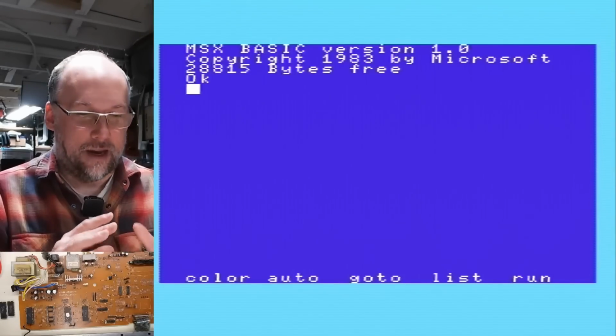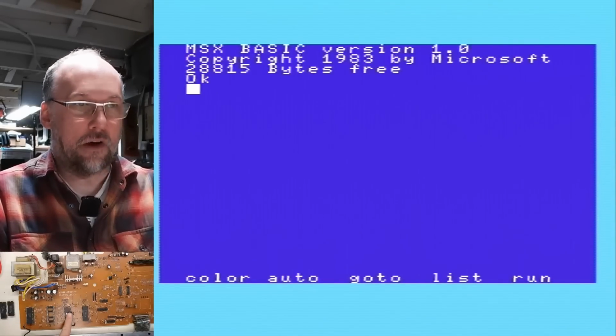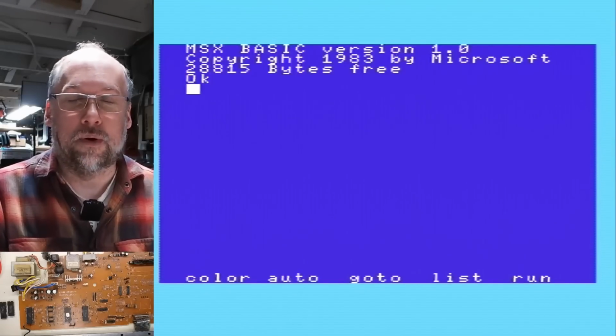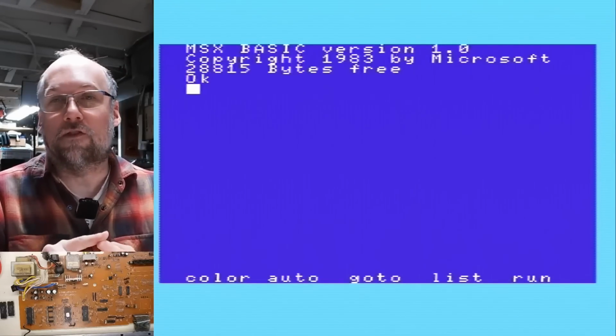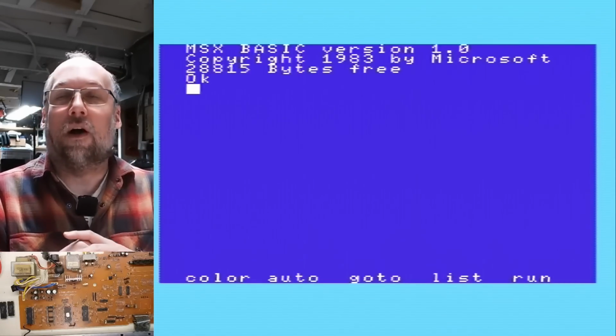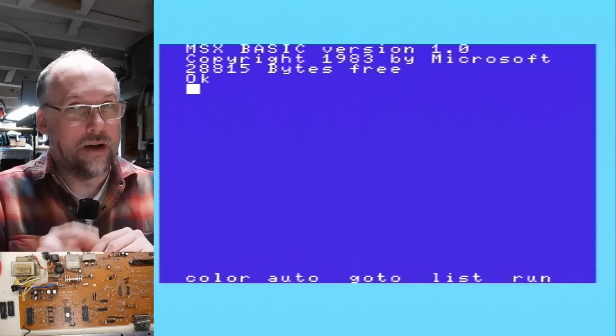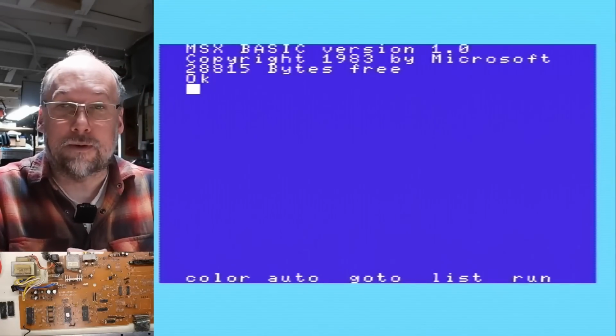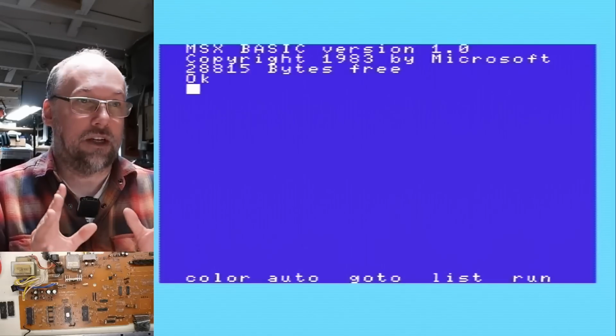So before I give up, I'm gonna erase those TI ROMs and let's try again. Okay, I've tried 3 different games and none of them seem to work. In fact, in the ROM right now is Load Runner. That's in the top 32K, and you can see it's just booted into basic here. I had tried Choplifter and Galaga, and those caused those weird reboots. And that weird static we were seeing on that one basic screen was the EPROM. I tried a different chip here, even though it looks the same, it's the same type of chip. Obviously we have no static and the machine is working fine.